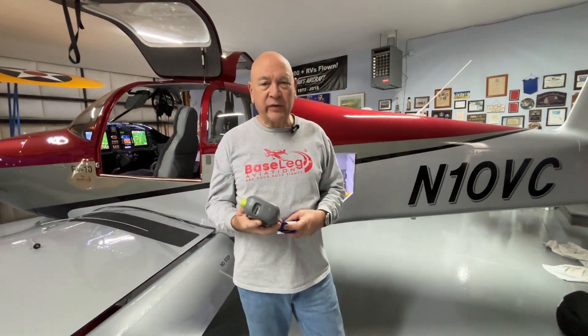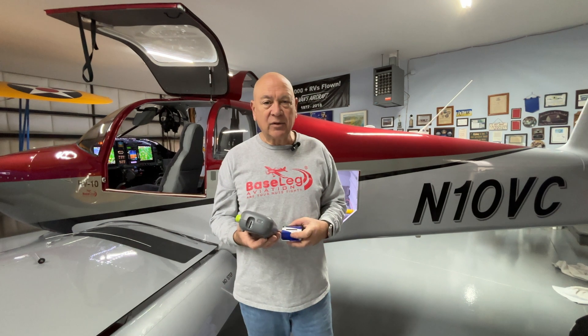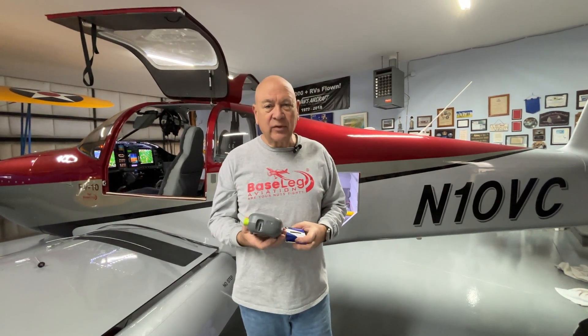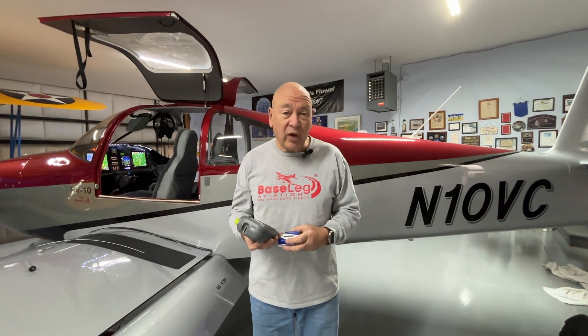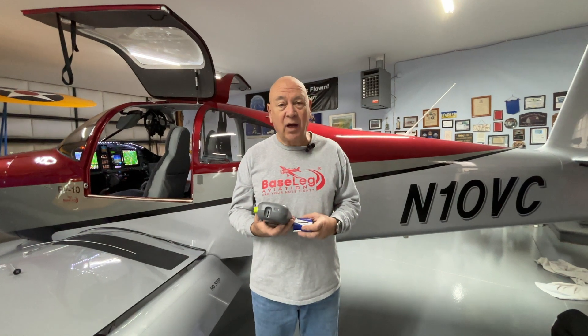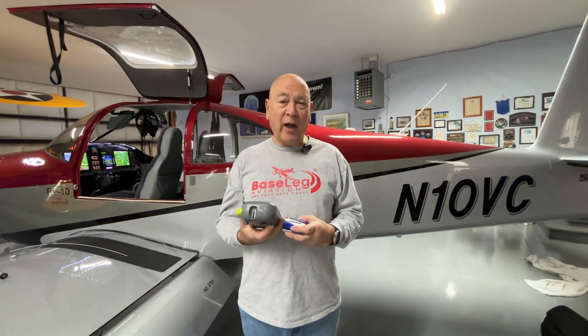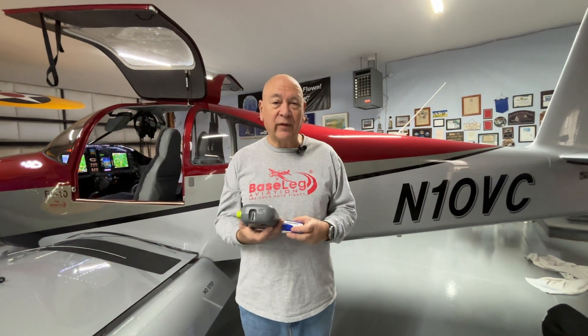Overall, this is hopefully just meant to be a motivational exercise for those of you who've maybe purchased an airplane and are now the second or third owner. The ones I'm seeing on pre-buys are 10, 15, 20, 25 years old, and you can do the upgrade yourself — it's not that difficult. Do it one wire at a time, disassemble everything, label everything. The stuff you get from suppliers like Advanced Flight Systems comes pre-labeled, all cut properly, and they'll even make a lot of the wiring harnesses for you. It works pretty reliably once installed — it's just a matter of taking your time and you end up with a really new modern panel. The capabilities in today's avionics are just absolutely amazing — they definitely rival or exceed the airlines. Have fun, and I look forward to seeing some pictures from some of you tackling your own panels. We're looking forward to some trips we're going to put on this one this summer. Take care.